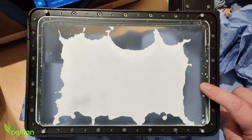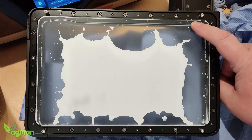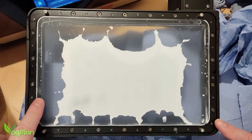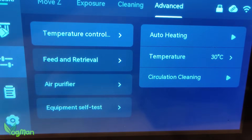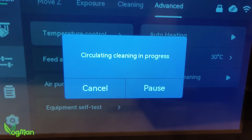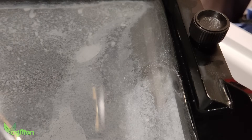Also, upon pressing the liner, it's clear that in places the metal of the tray is not tightly in contact with the FEP, which could allow the resin to flow from these channels into the main area of the tray. To help prove this, and knowing that the resin I'd originally used was water based, I added clean water to the tank. I then ran the heating system to see what would happen. There is in fact a cleaning circulation feature that achieves the same thing, which just runs the content through the pump with a view of purging leftover resin. Straight from the off, I could see bubbles, something I hadn't noticed previously. And as the minutes ticked by, I was able to see visual evidence of water movement and eddies.